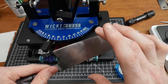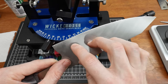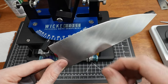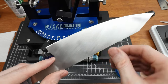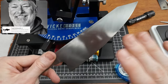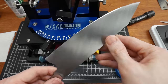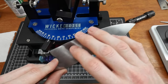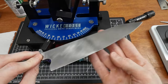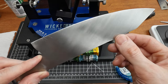One thing I will note: this is a very tall blade and also pretty long, so the stones actually have the opportunity of coming off the secondary bevel and scratching your primary bevel, and I definitely did that right here on the back. This can be mitigated with practice and knowing how to use the stones appropriately — I'm still new to the system. I've also seen guys like Tyrell from Tyrell Knifeworks put an entire piece of tape on both sides of the primary bevel to protect it from mishaps like this. I'll just fix the scratch on the hand sanding bench. Overall, I'm pretty darn impressed with this machine — going from no edge at all to pretty much razor sharp in 33 minutes is pretty good performance.